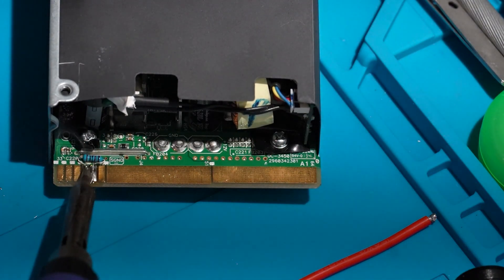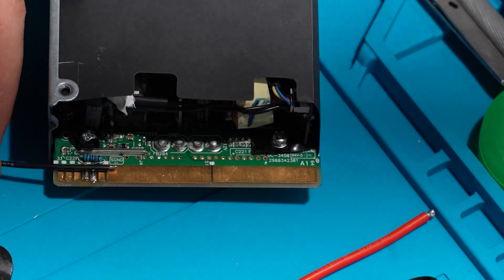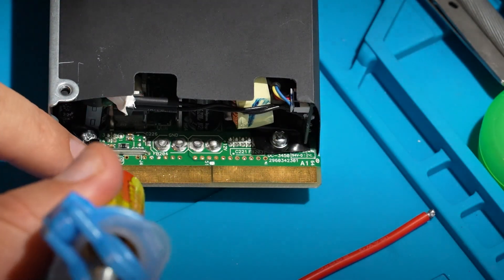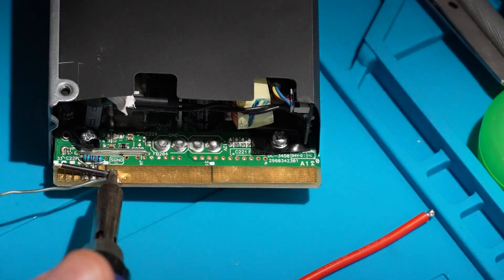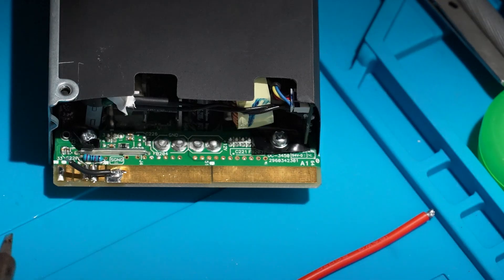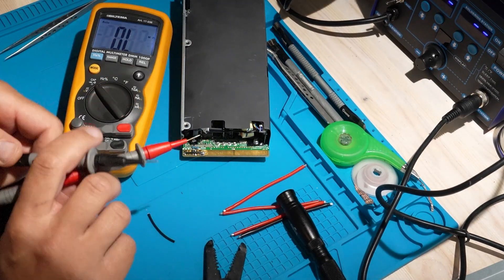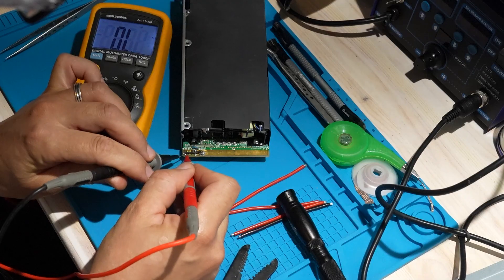Keep watching to see how I install the resistor and jumper as neatly as possible right near the PCB. Doing it this way prevents them from being accidentally bent, broken, or pulled loose. After soldering, I always test with the voltmeter to make sure I didn't create a short or connect the wrong pins. Better to catch a mistake here than after powering on.